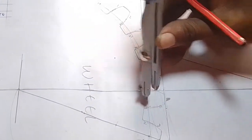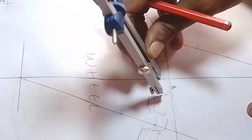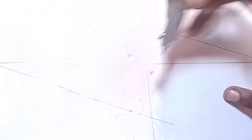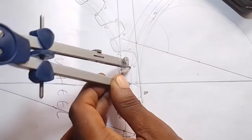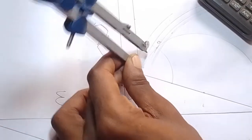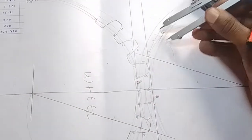This is the 1.6 from this point here. After you have gotten 1.6, stand again on this middle part. Along the PCD — you can make a mark here along the PCD. Make a mark. Stand here again and make a mark. Like that — make a mark. Turn your pencil to this other side so that you can face the right side. Make a mark along the PCD. Make another mark along the PCD. So you have been able to establish all these points.